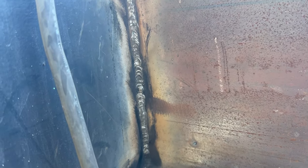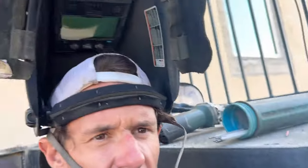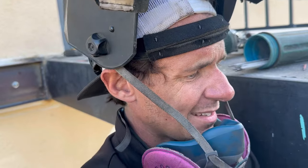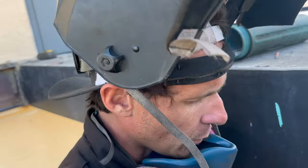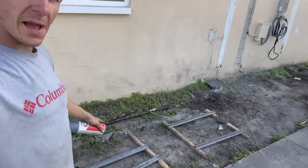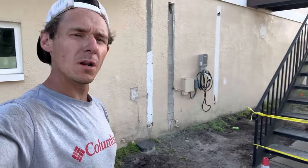Here are a couple of the roots — not great, not horrible. Pretty decent. I'll weld the outside as well as the inside of this corner. I left a little gap so water can shed. Nothing is plumb or level on this thing so I'm just kind of making do. I've never run into one of these that was fully plumb level — I think they settled over the years. We're going to weld this out and then add that angle iron up underneath to give the pan a little extra support. The little piece of landing I needed to put in is all together now — I just need to put some high temp primer on these pieces so the backsides don't rust out.